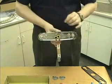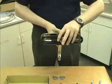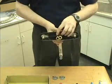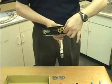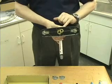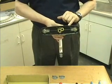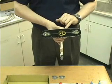You have two bolts that stick out the bottom. You have a plastic trim piece that is designed to help keep the water from flowing from around the faucet down underneath the sink. You can put plumber's putty or other material underneath this plastic piece. But do not get plumber's putty on the chrome finish of any faucet — it doesn't matter the manufacturer. Plumber's putty has an acid in it that is designed to create a seal, and if it gets on even chrome plating, it will in time eat the finish away.